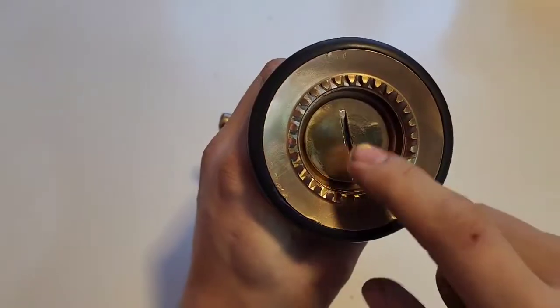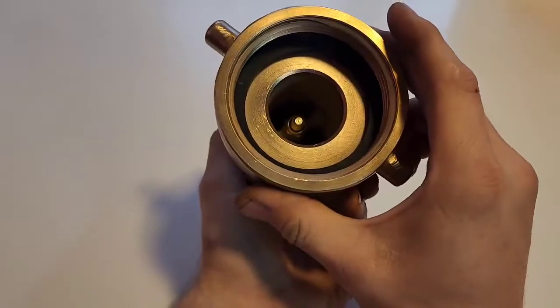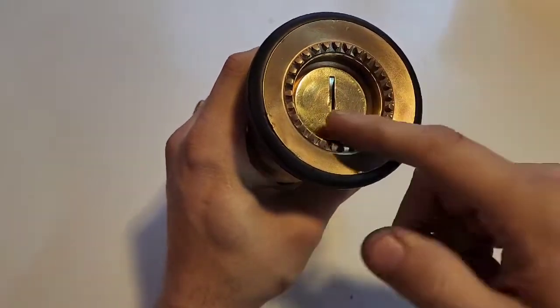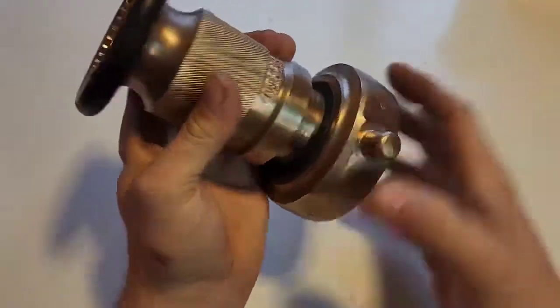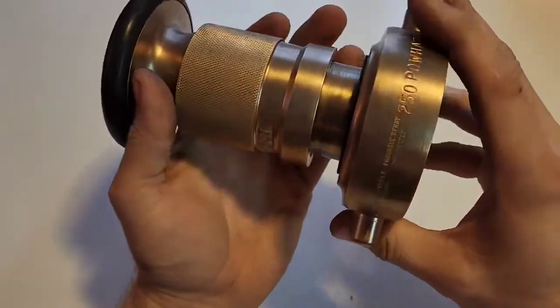You always make your softest piece — the brass here — removable or replaceable, because that is your wear item. There's a bolt down in the bottom there, and if you take that bolt out, this piece can pull out, either be remachined or relapped, or put back in with a new piece to be resealed. And then this is for your fire department connection for actually popping these on and off with a special wrench, or hit it with a hammer to knock it off — both work just as well.